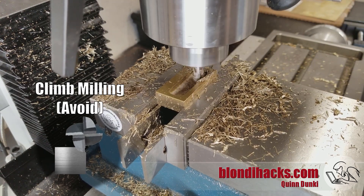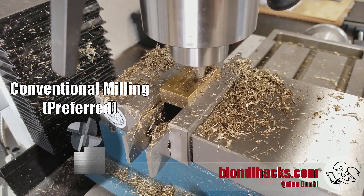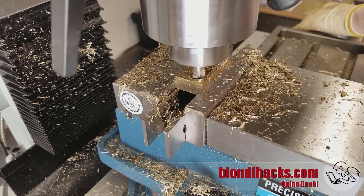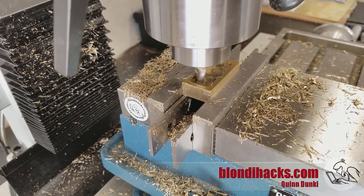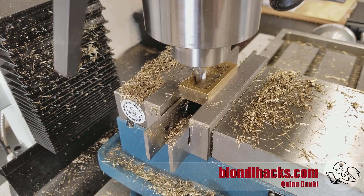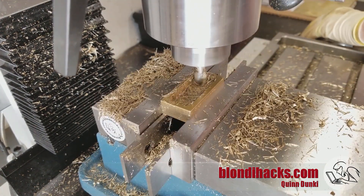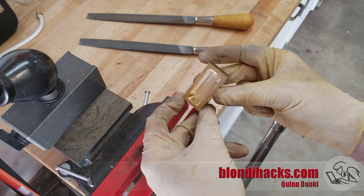I'm doing the south-facing edge first because I want to make sure that I'm conventional milling, not climb milling. When we go to do the far side, we're going to go the other direction. Each pass I'm winding back — I'm not milling back and forth. I'm going to get into the corner using my DRO and feeding by hand just to get a nice corner radius. The far side is milled the other way again so that we're conventional milling and not climb milling. You can see I've got the cavity filled with WD-40 there, just to serve as flood coolant.